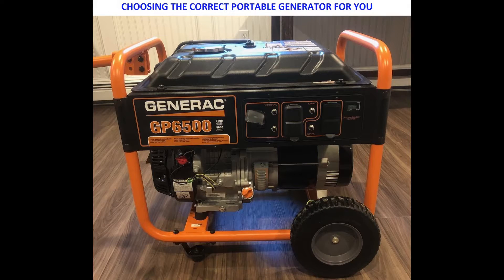When you're on generator power, you can power whatever it can support in your house — within reason. It's going to depend on the size of the generator that you have. I recommend our customers go with at least a 6,000 to 7,000 running watt generator. That should allow you to run your general lighting, general outlets, definitely your microwave, your fridge, your heating system — given it's powered on oil or gas.